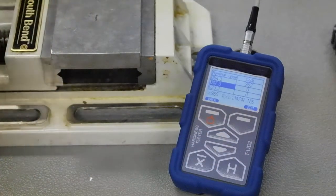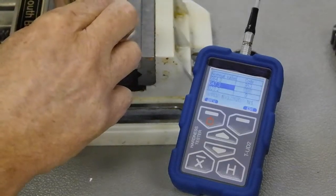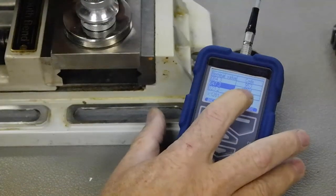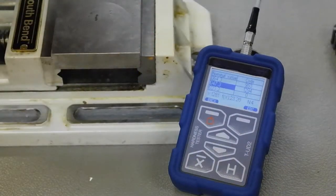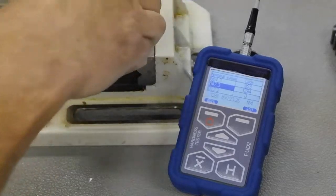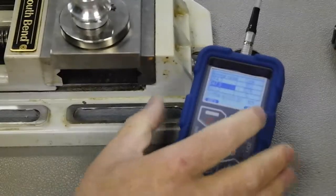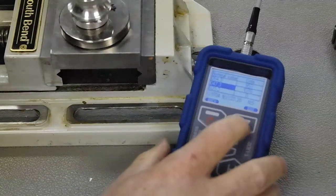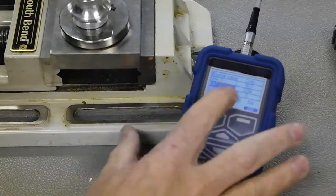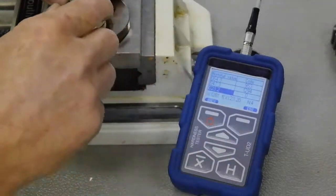Let's do it more quickly now. Go to the next one, ring my part to my block as best I can. Three quick: one, two, three, four. You see it's a greater number. Going to the last one now, which is the 23 block — ring it. I made a mistake: I forgot to move down. I'm going to go up to edit and delete that one. I've just deleted that last test and I'm going to go down to the next one. I've saved myself having to redo it again — I could hit delete again to delete all of them, but I've just corrected that.